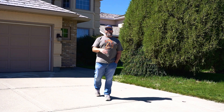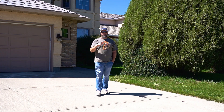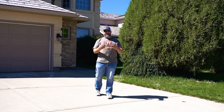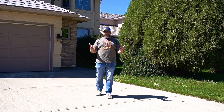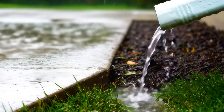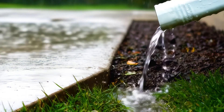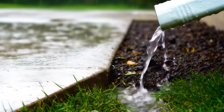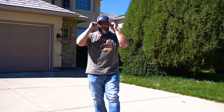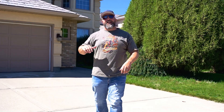The other reason we like foam is it doesn't ever erode. Polyurethane foam doesn't erode, so if water hits it, it's not affected. But if you've got a sand-based grout like mud jacking material and you have drainage issues, water hitting that will cause the pad to re-sink. With foam, the only thing that breaks down polyurethane is UV light, and when it's underneath concrete it'll never see daylight — it could live there forever and never degrade.